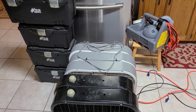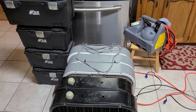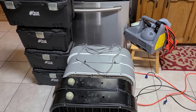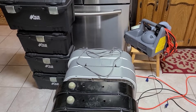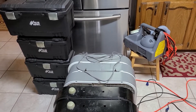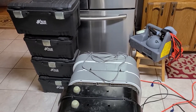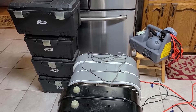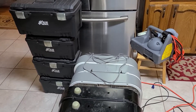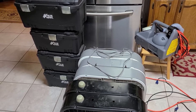These machines are all 10,000 and 15,000 milligrams per hour. A lot of times people try to get away with buying smaller machines — anywhere from 1,000 to 5,000 mg/hr. Those machines simply can't do what the larger machines can do. For a really small area like an automobile or a very small room they might be effective, but for larger areas like living rooms they can't produce enough ozone to overcome the natural depletion rate and the working rate. The key to ozone working — both for odor removal and sanitizing — is ozone saturation. You have to saturate the area with ozone, and if you do that, it'll work 100% of the time. The only time ozone won't work is if you're using too small a machine in too big an area.